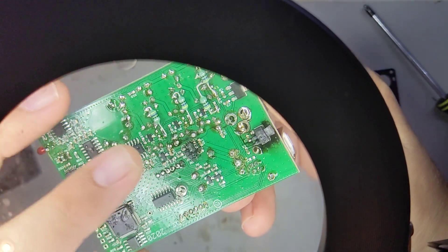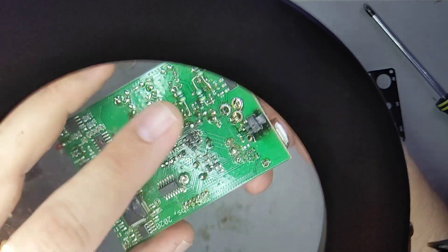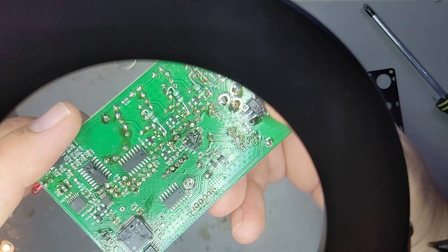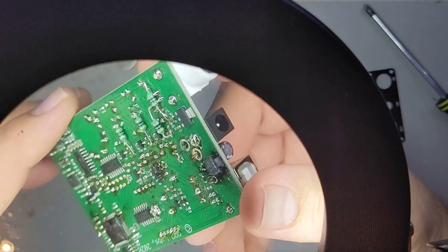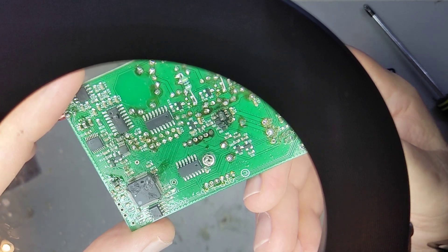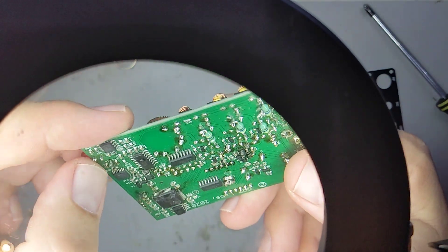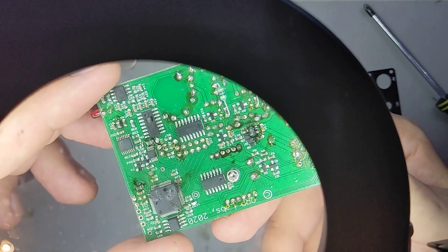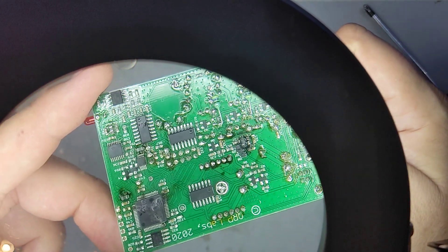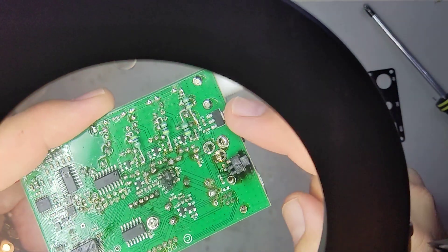Some people have done modifications to this where they feed the 3.3 volts from the 5-volt rail instead of from 12 volts, which is a good modification and one that I should have done actually. So it looks like the 3.3-volt regulator just overheated and went kaboom. I got off work a little after four o'clock and came back in here about 7:30, so somewhere in that time things went kablooey. I'll be on the list to order one from the next round of QDXs, which has a lot of improvements — including that the 3.3-volt regulator is fed from the 5-volt rail instead of from 12 volts.